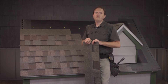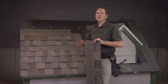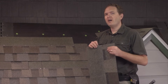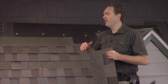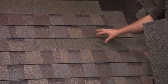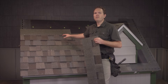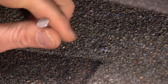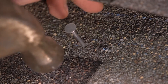Also, make sure that you place your nails at least six inches away from the butt joint of the shingles above it — you don't want to nail right where water is coming in between the two shingles. Next, don't forget to nail the top shingle back into place as well, since you took nails out of both the damaged shingle and the good shingle on top. When nailing the top shingle back, I like to nail into a new place rather than through the old hole, which is compromised — just a little to one side or the other.